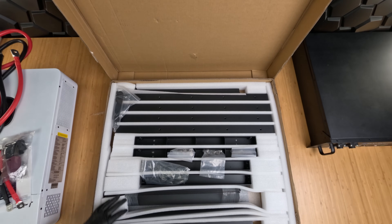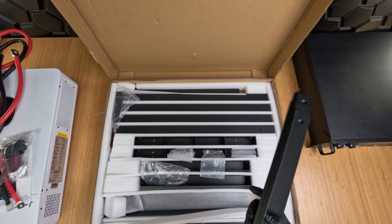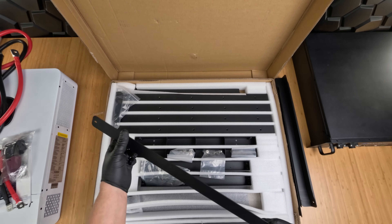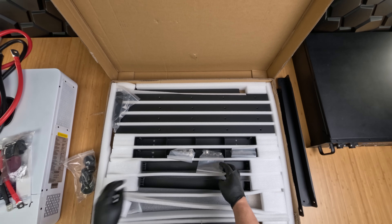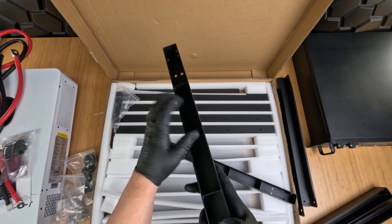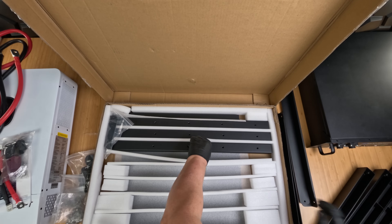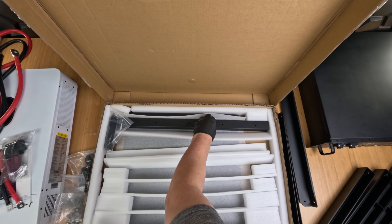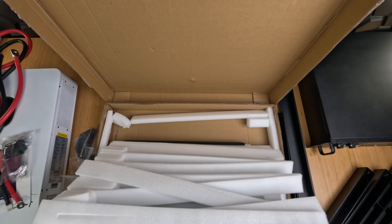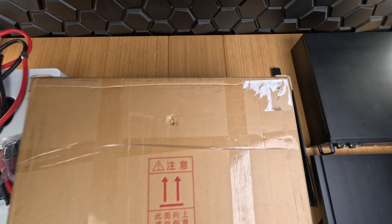Lastly, we have our four-layer battery rack. This is a server-style rack designed to withstand the weight of our four batteries. It's made up of galvanized steel with a scratch-resistant coating and can support up to 800 pounds. This one is four layers, but there's also a six-layer version available. Overall, this helps to hold all your batteries in one place and minimize the footprint by being super compact. The rack has an open design, which allows the batteries to breathe and disperse heat easily — super important for optimal battery operation. The version we have here does not have wheels, but there are some options with wheels for added flexibility.